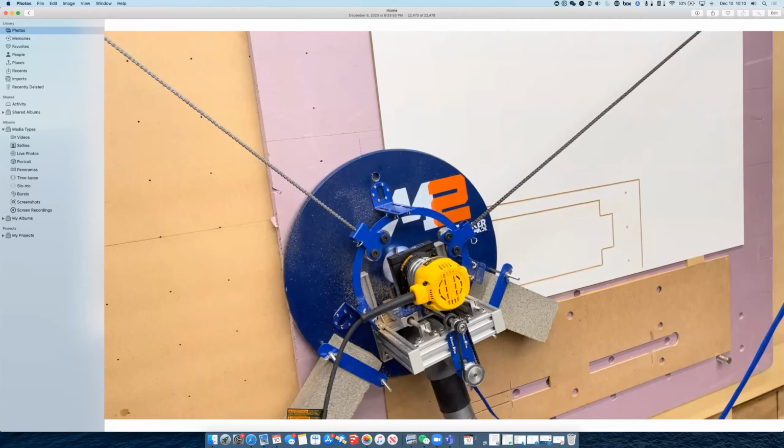Once you're in this standard, you've got these 3 millimeter holes, then you can bore out 20 millimeter holes on that grid and then use standard, what they call bench dogs, to support work pieces and get an always perfect, straight right angle grid. That was my biggest fear from my old days of trying to do something before I got serious: always having things be a little out of perfect square. Absolutely. This way you're always perfectly square, as close to CNC perfect as you can get.